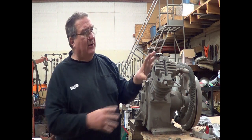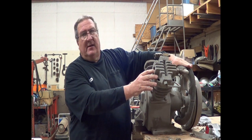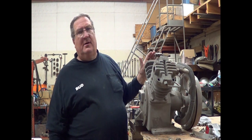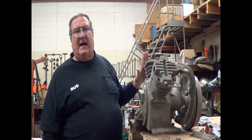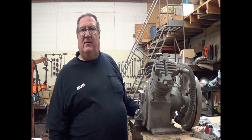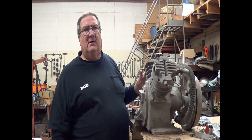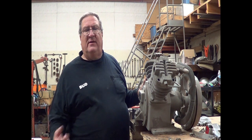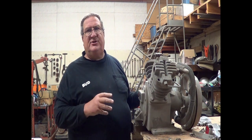When they unloaded it, it only unloaded the intercooler but it didn't unload the pressure between the high-pressure discharge valve and the tank. And on some of these they didn't even put a check valve in because it actually stopped the air there. So the compressor would actually start harder than the old 24-2s. And so that was one thing they changed.